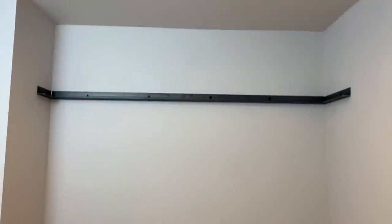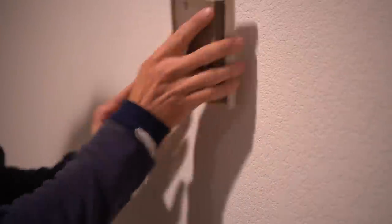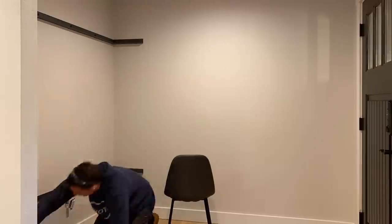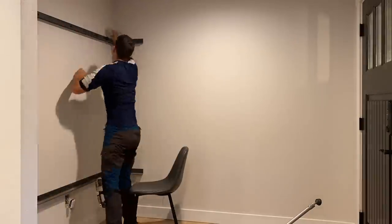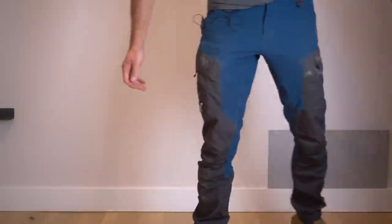You could just install your bench and shelf at this point, but we really want to dress up this entryway, so we're going to prep the surface for our stick-on tile accent wall. The key thing to think about when installing this type of accent wall is to really prep the surface so the adhesion sticks properly. I take 100-grit sandpaper and sand over all wall surfaces multiple times, then wipe down with a solution of TSP and water to remove any loose dust, debris, or grease that's been on there for potentially years. Don't skip this step even if you think the tile is sticky enough.